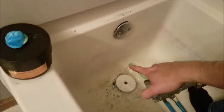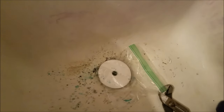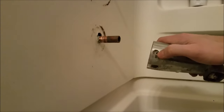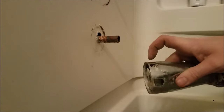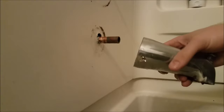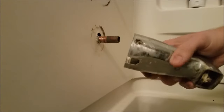A couple points before I sign off here. One: make sure you cover the drain — you don't want all this debris going down into it. It's not going to be the end of the world because it's just small shavings and they'll get flushed through, but it's always best to contain your mess and clean it up. Secondly, if you're using this method I highly recommend using a drill punch — that way it creates a little divot and makes it easier for the drill bit to go in and it doesn't walk on you, because obviously it is a curved surface.